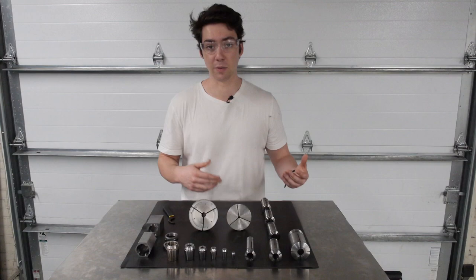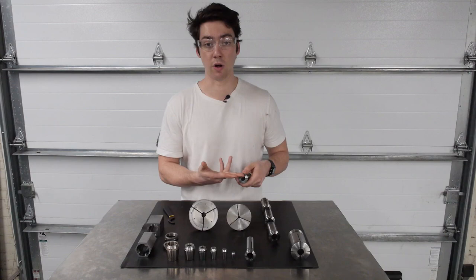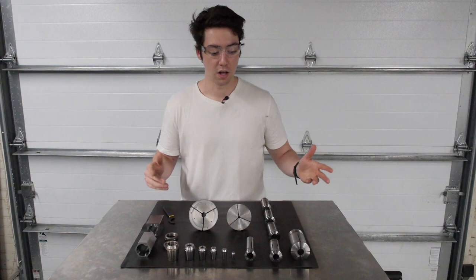Also, given the strict tolerance range, collets are easily damageable. If you were to put a size of stock that was too small for a given collet, tighten down on it, and put it within a chuck, you can permanently damage the collet. Also, you can't do eccentric turning with a collet — you can't mount it in a collet chuck in a way that makes it spin around an axis that's not the center.